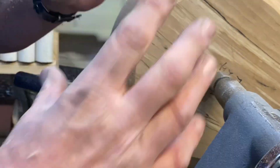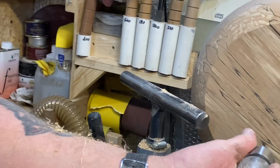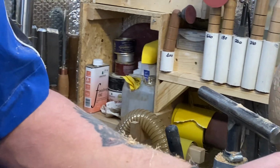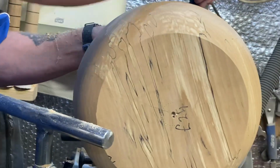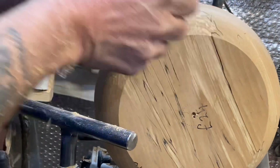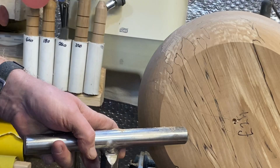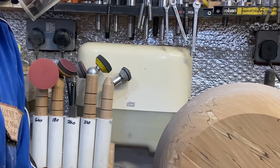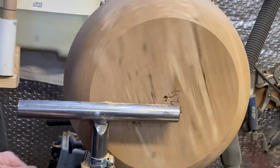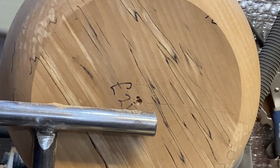And like I said, I'm going to have a big recess and that's going to stay there. So I'm going to take my centre away. I'm going to get this out of the way for a minute. Right, okay. I'm just going to check that everything stayed tight there. Yep, that's it. Don't over tighten, don't go wrenching, you just damage fibres. Right. So now my chuck jaws are 130mm for these big jaws. Now I've got my caliper set for this.